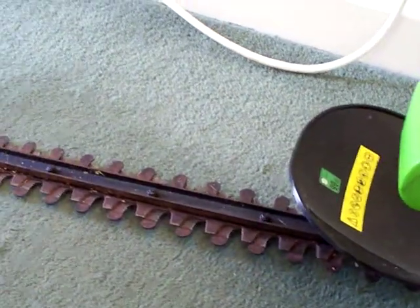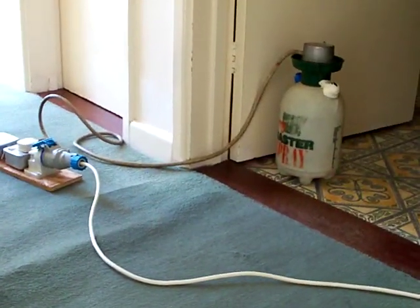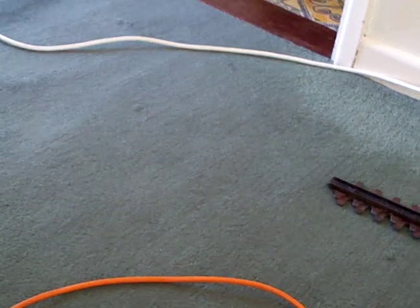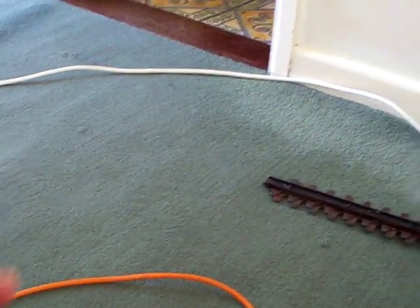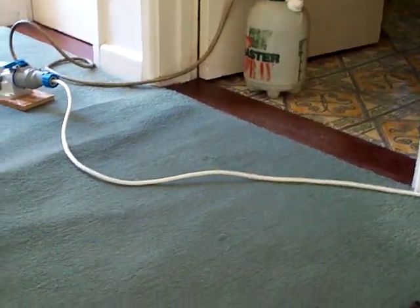You press it in first and then press the trigger and it fires up, but I don't want to do it straight on the mains. So what I'm going to do is break out the fun jiggery pokery unit, ballast it with the 3kW water heater, and then plug it into that socket over there. If it decides to go pop it hopefully won't be as dramatic as straight on the mains. That's the 3kW water heater — the socket is wide open in terms of current. I don't know the wattage on this thing yet — oh, it's 400 watts, there we go.